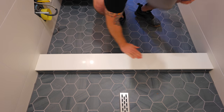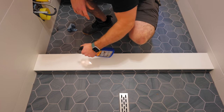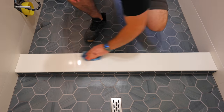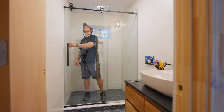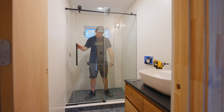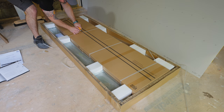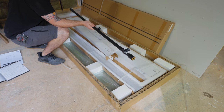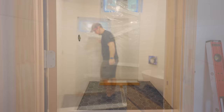Right off the bat I wanted to get the sliding glass shower door installed, but I needed to seal the solid stone piece I used on this curb first. These are pretty prone to staining and the manufacturer recommended sealing the piece, so I knocked that out before installing the shower door. I used this Vigo Cast sliding glass shower door kit, which I think looks awesome. I started the installation by getting everything unboxed and then moved the inner sliding door into the shower before getting the rail mounted, since it would have been really hard to get it in there with the rail in the way.